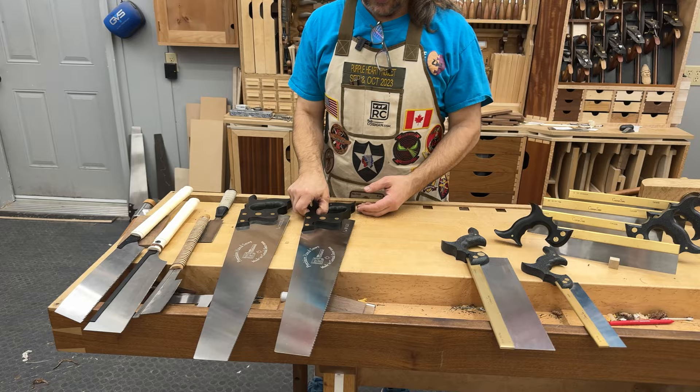I want to do a little test to drive this home. I took two brand new saws out of inventory — sharp as they come. I've got a piece of walnut that's about 13 sixteenths. This is the dovetail saw — 15 tpi rip. I'll count strokes with the same pressure: one, two, three, four, five, six, seven, eight. Now here's a crosscut saw, same frame size, 15 tpi crosscut: one, two, three, four, five, six, seven, eight. There's how far I got through the wood on the two different cuts — not a huge difference, but it shows the distinction.